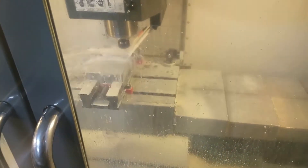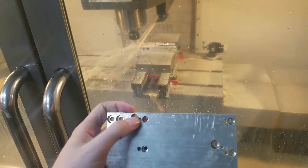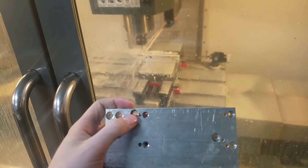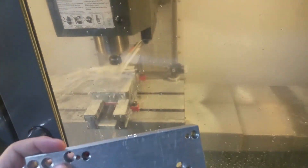In case you're interested, this is a fairly easy process to set up because, as you can see in the machine, I just have a little subplate — a subplate that I bolt the bodies onto one side of it, and then I just go. I've got a standard vise in the machine right now. I don't have to deal with any multi-axis stuff. When we do production work on bodies, normally we put them on a fourth axis and it rotates around.